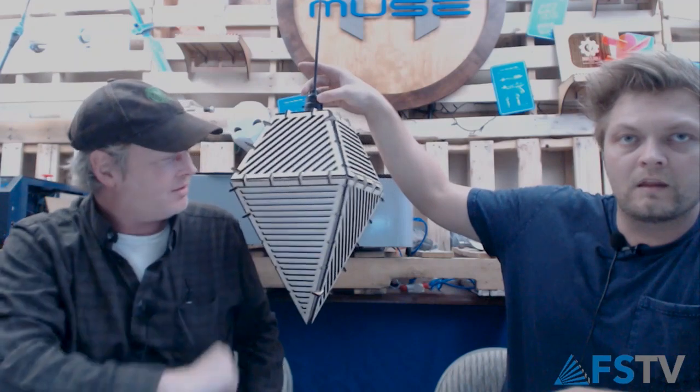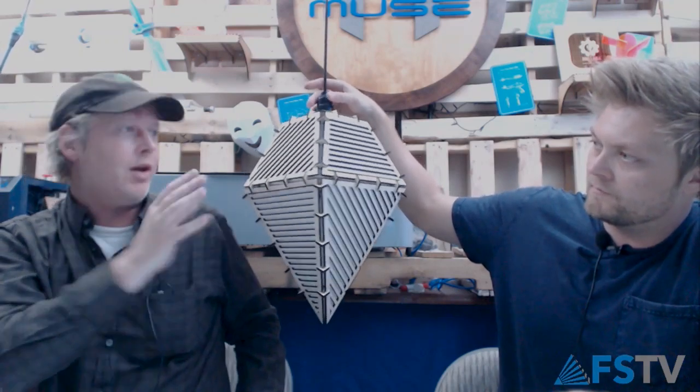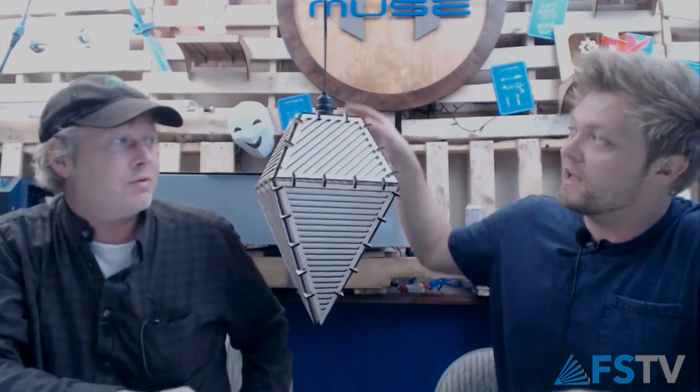This was over-engineered completely. It took longer to design it than to make it. I've never done any sort of paneling notches like this, so it was my first go. There were some hurdles, but I like the way it came out. If we turn off the light, you can see the panels a little closer and start to see the level of detail. You can always change these interior designs to whatever you want — you could make characters, an Alice in Wonderland theme or something. You can allow more or less light through depending on how thick you keep the slots. If you want to add paper behind it like a lantern, the paper blocks out the main bulb too, which is nice. A lot of people make light fixtures that don't block out the main bulb and it's hard to look at.